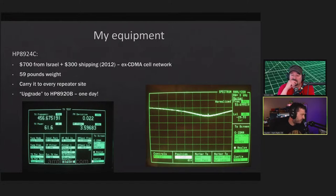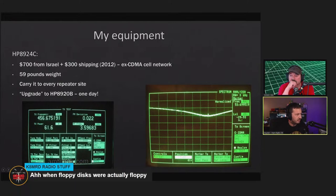You can see two types of measurements on the HP8924: on the left it shows frequency, output power, and deviation; on the right is return loss of a 6-meter antenna, showing a value like -29 dB which you can convert to SWR using an online calculator. This means you could almost skip the nano VNA if you went straight to a spectrum analyzer with tracking generator capabilities.